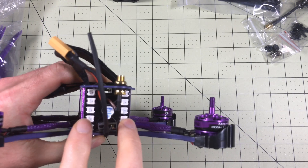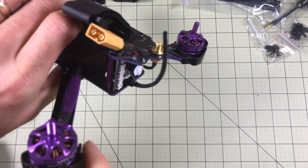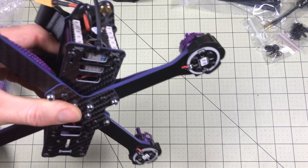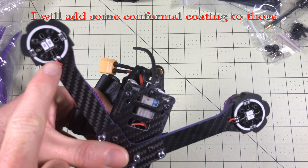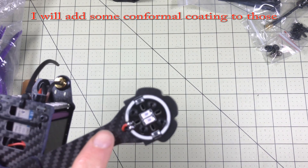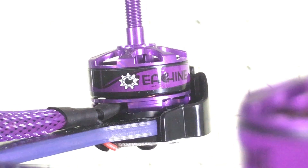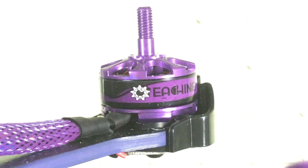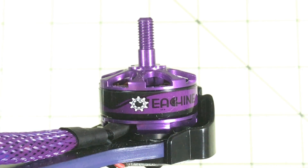It's kind of interesting — there are LEDs on both the back and the bottom of the quadcopter. So when you're going along level you'll see them from the back, and when you're racing at full tilt you'll see them from underneath. We'll definitely want to put those foam mounts on here though, because there are exposed wires on the bottom. Landing in wet grass with exposed wires on the bottom is a bad thing. Also, these motors are already soft mounted, which makes a huge difference.